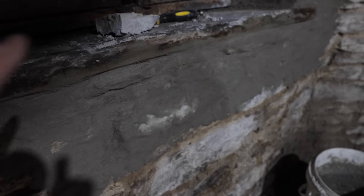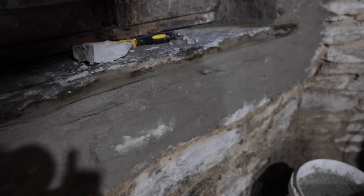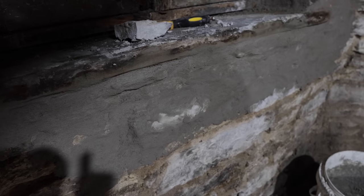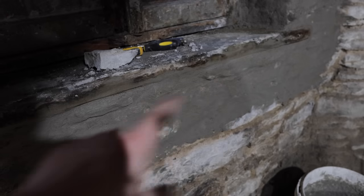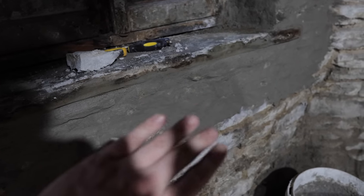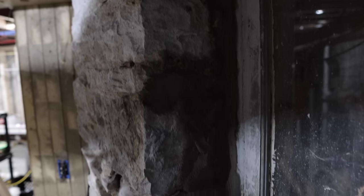Underneath the sill there were quite a few loose stones, so I took those all out, cleaned out the cavity, pushed them all back in, and filled it back up with quite a bit of mortar. I did backfill a lot of it as you probably saw on the time lapse. You have to make sure when doing this that you don't just put mortar around the stones as they go in — you need to backfill everything and then push the stone into it. We got this side done as well, so things are starting to look quite good down here.